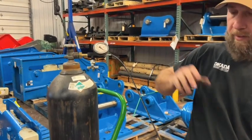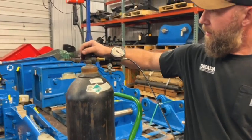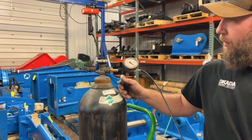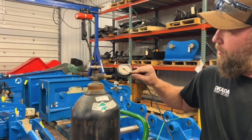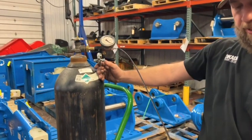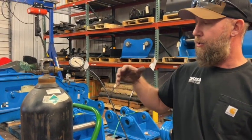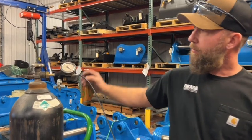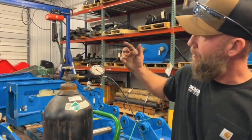If we needed more - and this also applies to the back cap - as long as your nitrogen is open, you can just open this valve slowly and let your nitrogen go up to whatever the spec is. I always recommend closing the hammer side off and bleeding the line and opening it back up, so you're not reading stored pressure in the line from the tank. You can see our gauge went up and we're right towards the top end of the range, which is fine.